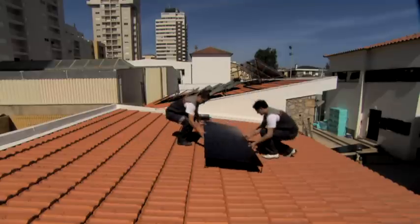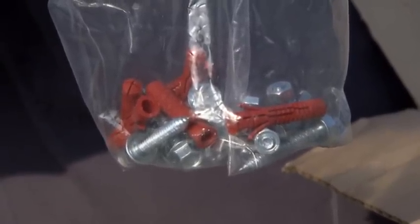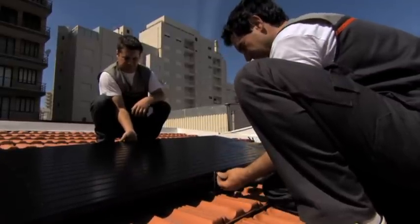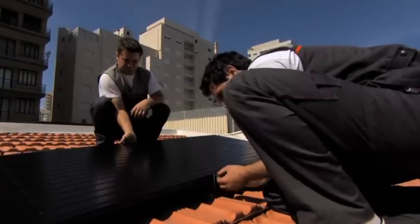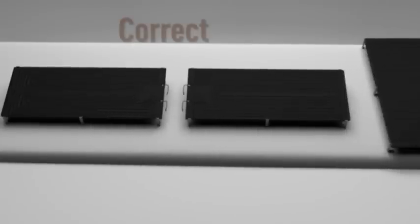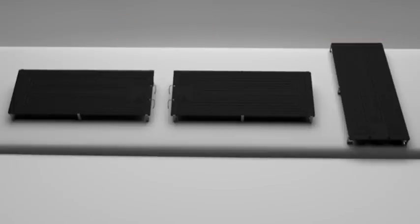The solar panels are secured to the brackets using six M6 screws supplied with the equipment. The fixing structure of the panels should have mechanical robustness capable of withstanding the impacts caused by bad weather such as rain, hail, and wind. It should also be noted that there are two types of panels: right panels and left panels. The solar panels should always be placed so that the longer edge is in the horizontal position with the connections facing downwards. With wall mounting, the execution is the same as with roof mounting.